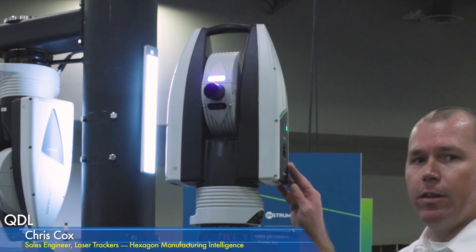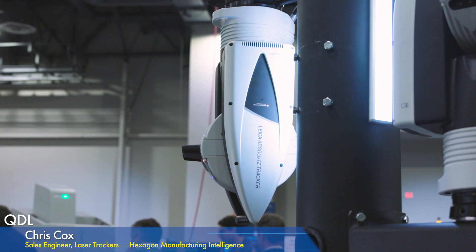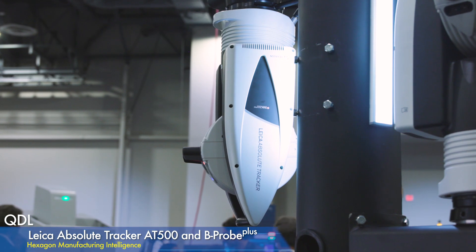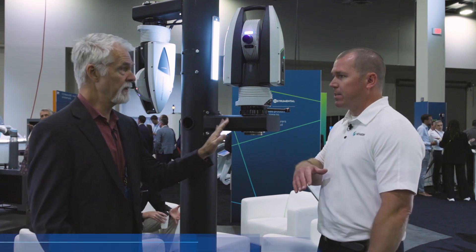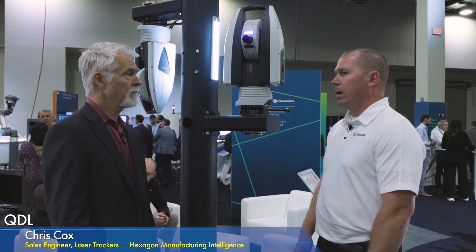For those 400 users, you had to have the 400 level to gravity. With this tracker, you do not have to worry about that — you can have it upside down, inside out, it doesn't matter. It's running 10 times faster than the 400 series at 100 hertz. So with that 100 hertz, you're able to do a continuous point measurement with your corner cube and won't skip a beat, which is great for metrology users who need to scrub the surface for doing a surface profile.